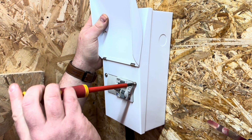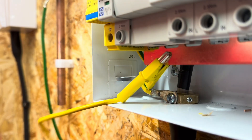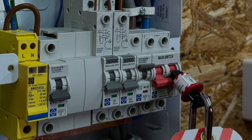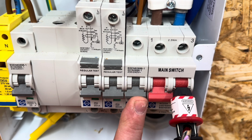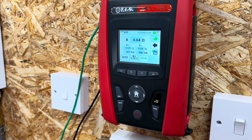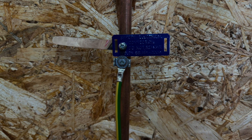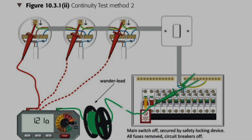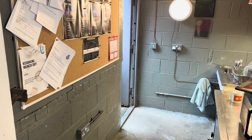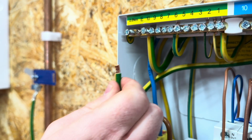The sub-main uses steel wire armoured cable where the armour has been used as a CPC. This is fine, but because the material is steel we can sometimes experience higher readings. I connect my link wire onto the bus bar and earth bar and switch the RCBO to the closed position — this creates a loop and avoids having to remove any conductors. We can also manually operate the protective device to make sure it opens the circuit, and this gives a really nice low reading. The next part of the test is the main protective bonding going to the water pipe, using test method 2. A diagram can be found in the Onsite Guide figure 10.3.1 ident 2. I disconnect the protective bond out of the MET and clamp it at one end.